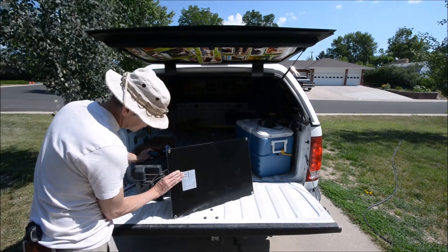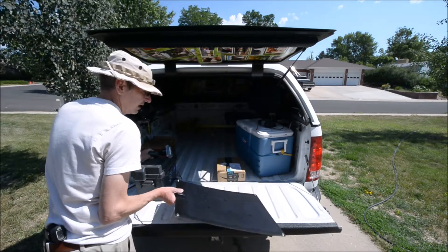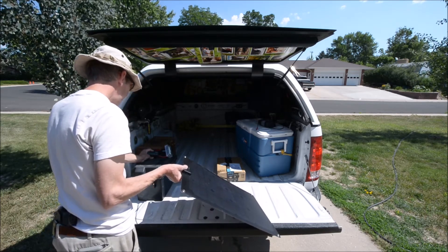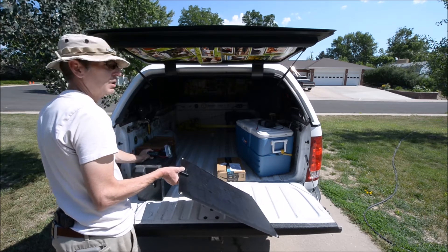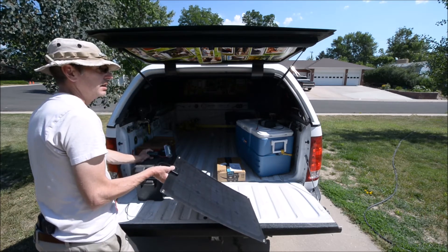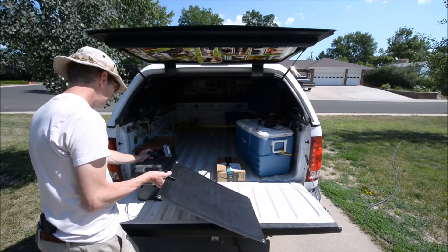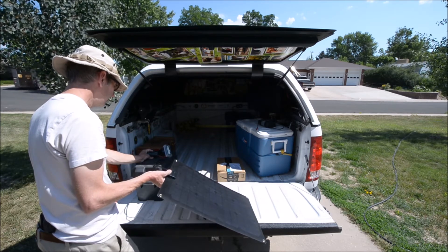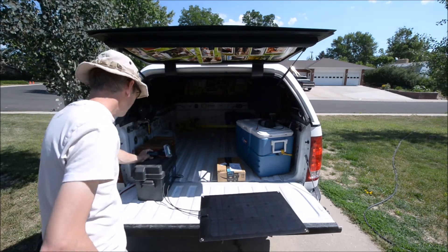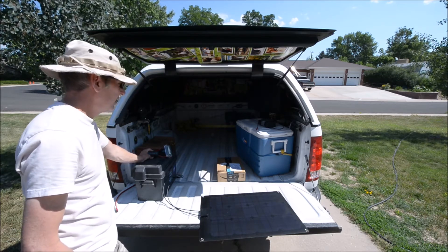It's charging at 15 watts angled. Maybe this is a 15 watt panel — though it says it's a 30 watt panel, so I'll put a note in the description. Right now in full sun we're getting just over 15, almost 16 watts at 1.1 amp charge rate. When I lay it flat it goes down to 12.4 watts at 0.91 amps. So very good info to know. It's holding steady at 15.6, almost 16 watts when angled.